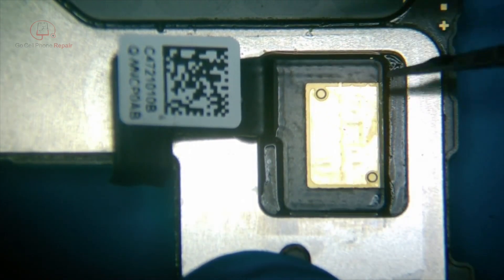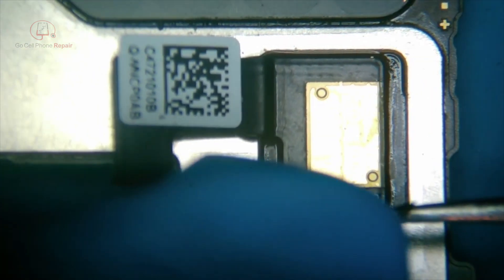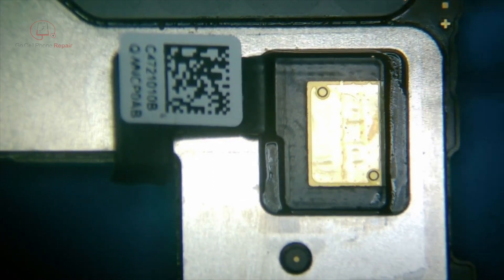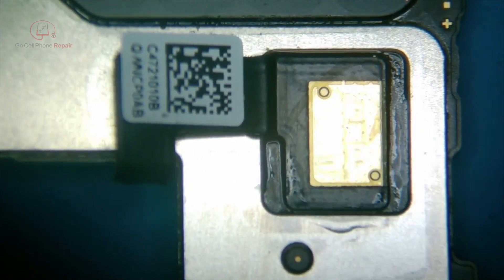You want to make sure the tension is coming from the adhesive and not from the attachment point. And to the technician who asked me — I do actually go over the pads with the soldering iron when I pull this off if I'm putting a new part in. If I'm just pulling it off to split the board, I don't mess with anything. But in this case, we're going to smooth these pads out when they come off.